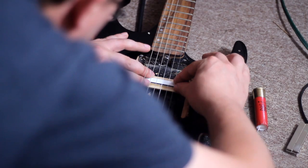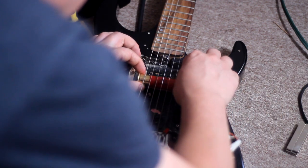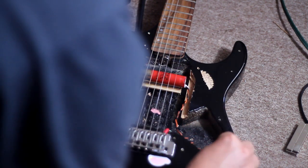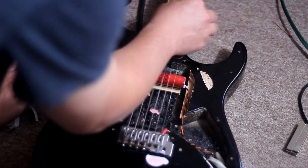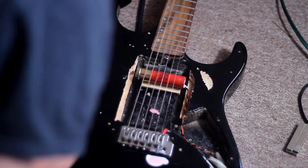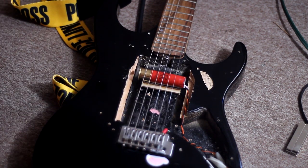And then I decided to take some double-sided tape and a little block of wwood and stuff, figure out my height and stick it down in the testing mule guitar while it was plugged in, strum a little bit. It liked to be in a certain orientation, which ended up with the label on the shotgun shell being a little bit more toward the neck. What really seemed to be going on is that it liked for the wires to be closer to the front instead of that flat work. So it was like the opposite of a pickup that has pole pieces in it.